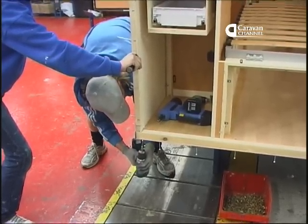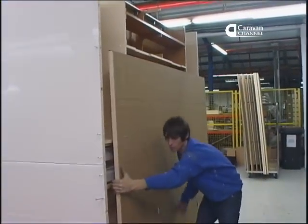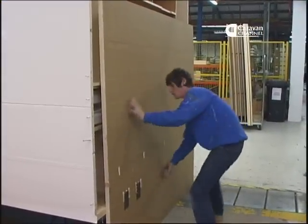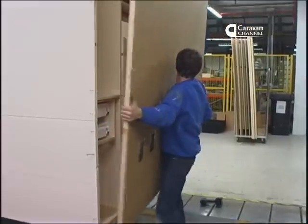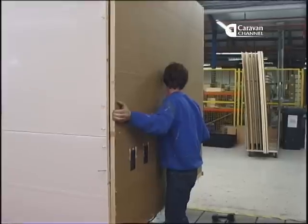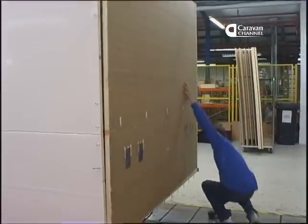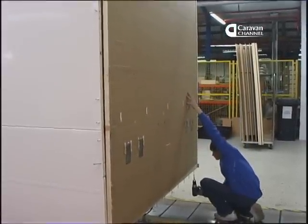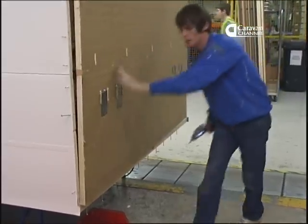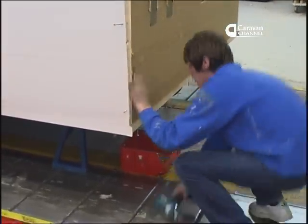The fronts were assembled as wooden framework structures, ready to take a GRP cover, and a back panel was added to take its own cover. Both front and rear covers were really decorative styling additions rather than integral parts of the vehicle's structure. Adding them added to the work involved and to the number of workstations on the line, compared to the new Bailey Alu-Tech system, which has completely changed the body build.